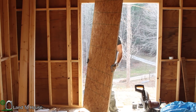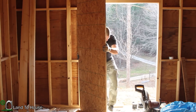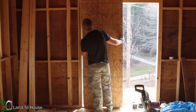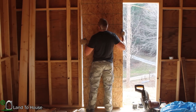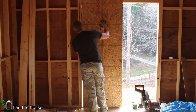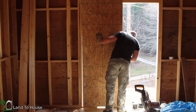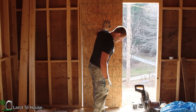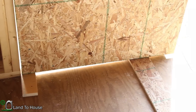This thing does weigh more than I was hoping it would, but with three hinges I think it's going to be alright. I was noticing that the door is off a little bit whenever I built the frame, which is definitely something I could have fixed. Also, I think the floor has a slight swell to it. I think the easiest thing to do would be to remove some of this space down here at the bottom, and that way I'll have equal spacing because I can work around the waterproofing down there. With a little bit of work, I've managed to get it pretty well up here. You can see there's just a little crack going down. I used a ¾ inch here and a ½ inch here, so the threshold is going to be a little bit wonky because the floor buckles up in the middle just a touch.